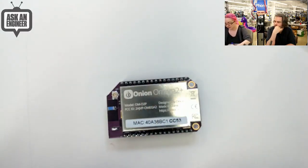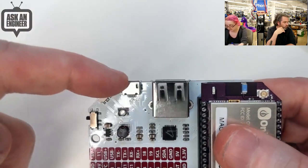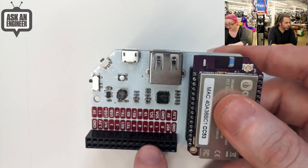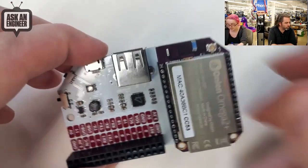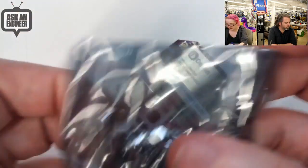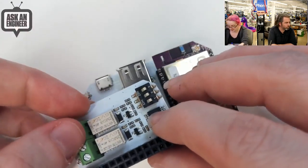We recommend the dock — that's why we got the kits. You plug this in because it's not breadboard friendly. Now you've got USB so you can connect a USB camera, mouse, or keyboard. There's a serial console chip so you can connect to a serial console. You're not going to get a graphical interface — you have to SSH or use a serial console. These are the GPIO available: I2C, lots of GPIO, and Ethernet as an add-on built natively into the chip. There are little add-ons that plug in — like a relay expansion with two micro-relays. Not going to power your washing machine, but great for little robotics projects.